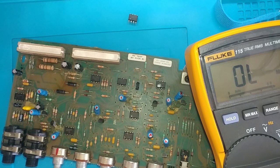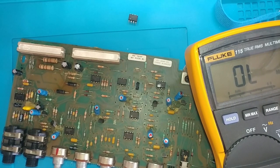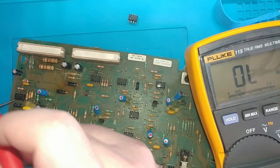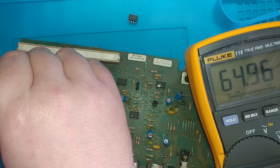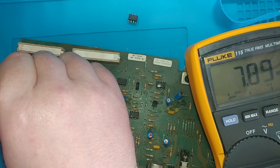And the next thing that we can check is from our first channel out at pin 1 to pin 7, second channel out. We're up in a range of almost 2 to 35 mega ohm. I think we should see mega ohms the same way on that. So pin 1 and pin 7. That was in 65 kilo ohms. Oh, sorry. Yeah, there we go. 7 mega ohms.